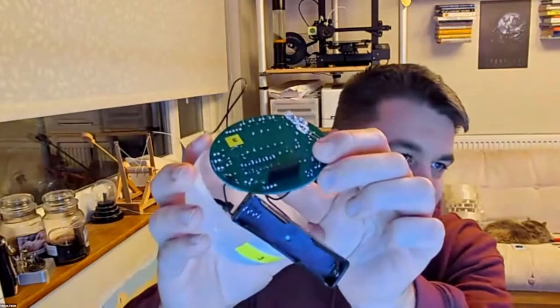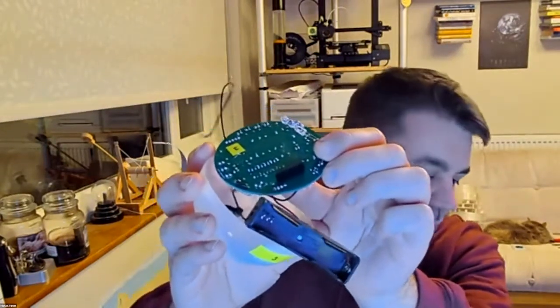And I also found quite a few other little issues, like, for example, the quality of connectors. So you can see that little connector there. It's just a sort of a normal pin header type thing. Those are not all created equal. And I had a lot of them that had intermittent or poor connectivity on certain pins that caused various problems. Like, for example, leaving the RFID reader powered up all the time. And of course, when you've got an RFID reader powered up all the time, it uses a lot of power. So there was various problems with the units not powering themselves down properly, and therefore running out of battery way quicker than I'd anticipated. But everything I did was about make it low power.